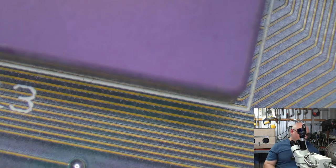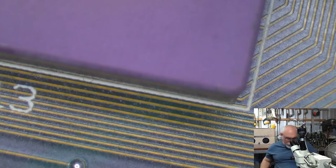Right. Okay. It's 1:30 now. I've got to get these caps on and get this tested. So we're just going to get these axial caps in place because I am running out of time. I need 1 220 microfarad. Bing. 220 microfarad. And I need 3 470. Bing, bing. Bing. Oopsie doozy whoopsie thing.